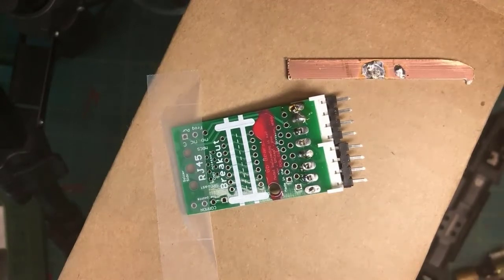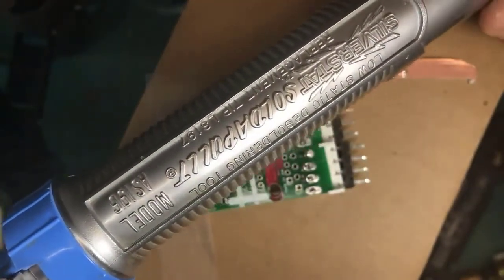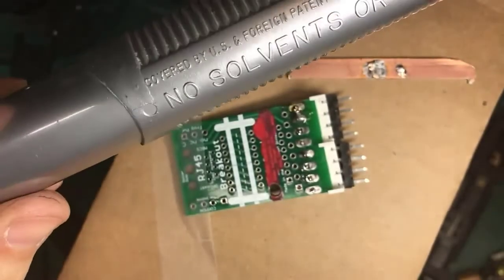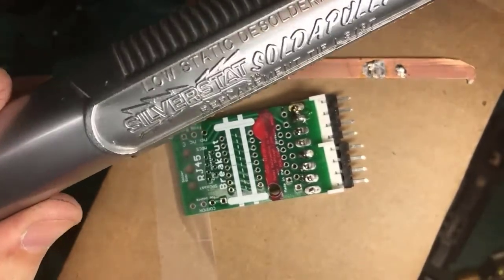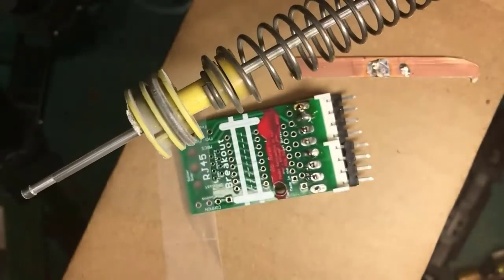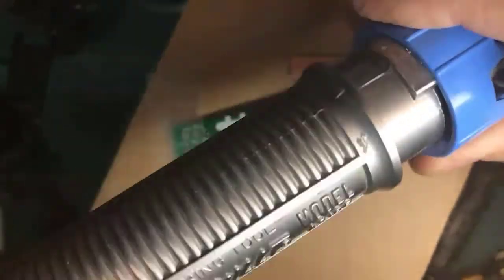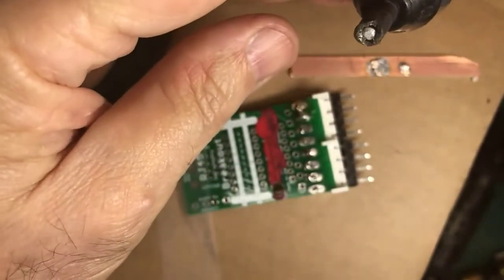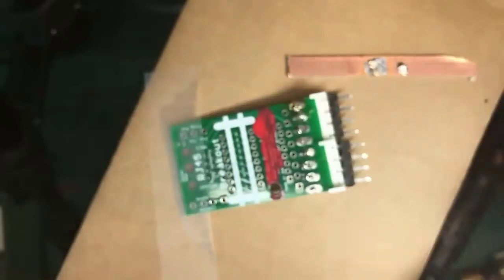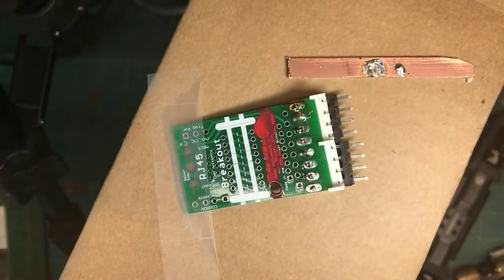Another tool that we electronics types use is a solder sucker. This one is a standard one, the Soldapult. This is basically a miniature hand-operated vacuum where there is a plunger down inside the tube. There's the plunger with a seal. And this guy has a tip, you can just see the tip there. When I press the button, it draws back quickly, producing a local vacuum right at the tip.